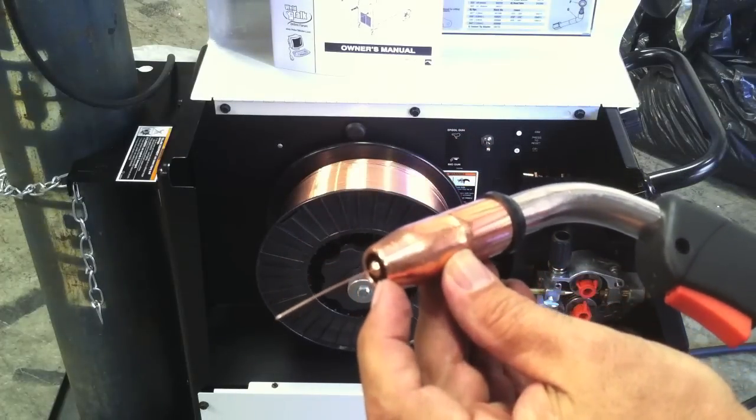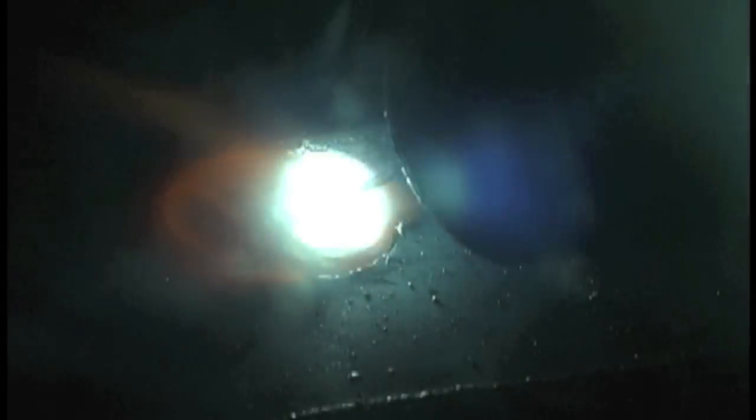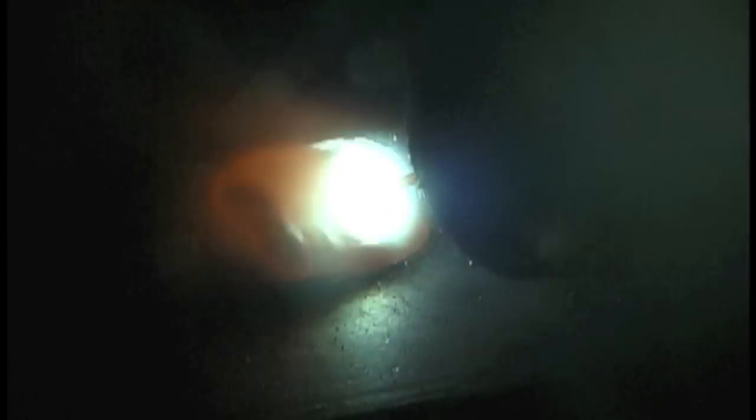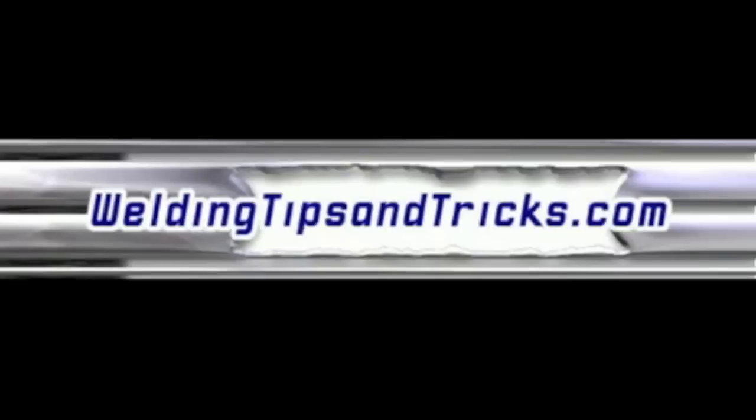A little review: quarter inch hot rolled A36 steel, pull technique with straight CO2, done all manually, so a lot of it is influenced by my technique. There are the nuggets on the straight CO2. Here is the 75/25 — you can kind of hear it's a smoother sound to the arc — and there's what that did; the one on the far right looks just fine. And here is the push using 75/25, trying to keep a short stick out and stay on the front edge of the puddle. The two nuggets on the left are the result. Thanks for watching — visit WeldingTipsAndTricks.com.